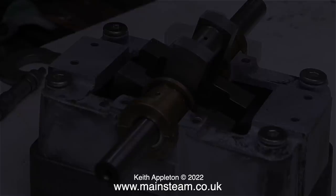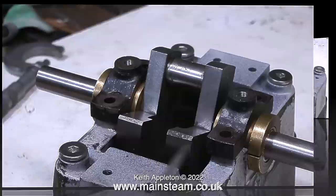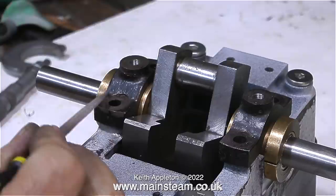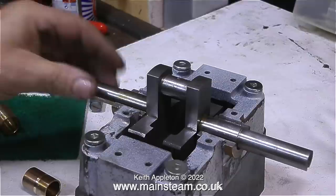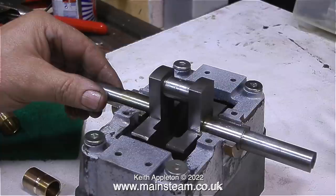It's a belt-and-braces approach, because this bearing bush is not going to rotate in the main bearings once the top caps are tightened down — the pressure of the split bearing will hold the bush in place. I'm now doing a quick dry assembly of the crankshaft with the top caps on, and there is a problem: one of the top caps is smaller than the other. Both are very substantial castings and even the thinner one has more than enough strength.